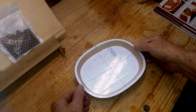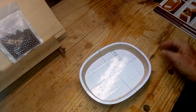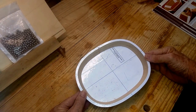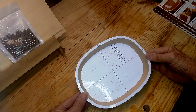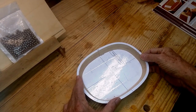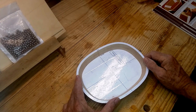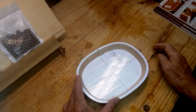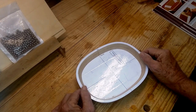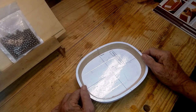I'm really pleased — it lines up really nicely. One reason I quit using clear tape when filming is that it can give you a glare with lights around. Anyway, I'm going to line that up and draw the circle so I can cut the second ring, which is also going to be at 23 degrees. First I'll take this pattern off, mark the top and the inside so I know exactly where it goes. Try to keep the grain of the wood lined up. Then I'll drill an entry hole and cut that one just like I did this one.